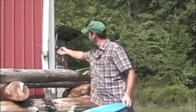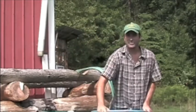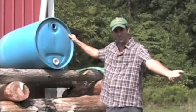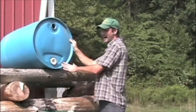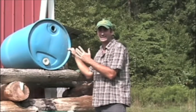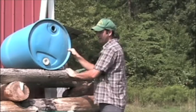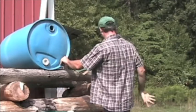Here's an empty one and this is the gutter I'm going to tap into. I like having my rain barrels up off the ground because for about every 3 feet higher you lift your rain barrel from where the hose will end up going, you actually double your pressure. I'm actually going to have two barrels, so combined I'm looking at between 700 and 800 pounds. I have kids running around here so I did not want to have 800 pounds of weight that could somehow fall over. That's why I went above and beyond with the log cabin structure, but I'm sure you can get creative and come up with your own design.